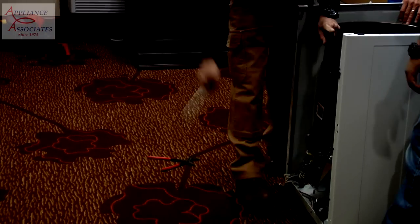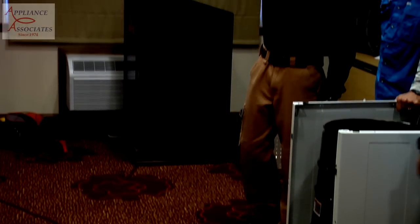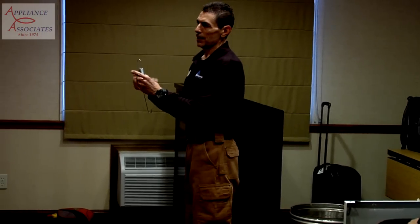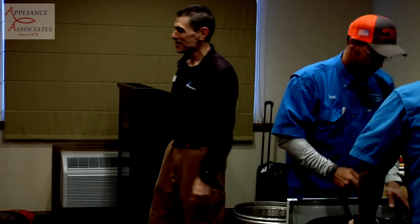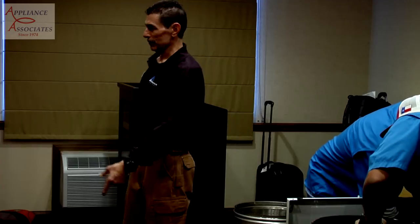And release it. And as you go around, this is much easier than the tool, only because the tool actually has a wide handle. And you start bumping between the outer tub and the side cap, and it makes it difficult. You'll scratch and cut your hands up too. You guys want to do that? Okay, so they're going to pull the springs off. We're going to pull the module out.